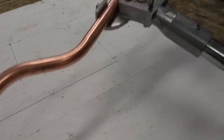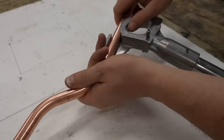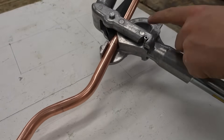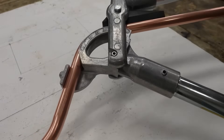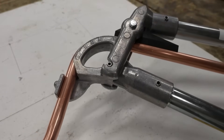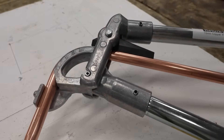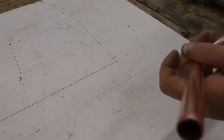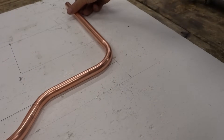Because we're bending this way and not naturally that way, I like to actually put it in the benders so you can guarantee you're definitely bending the right direction. Go ahead and offer it just after the arm. Put the former side in and bend all the way down to 90 degrees. These benders do have a bit of spring back when you let go, so make sure you just go a touch more. That should be perfect.